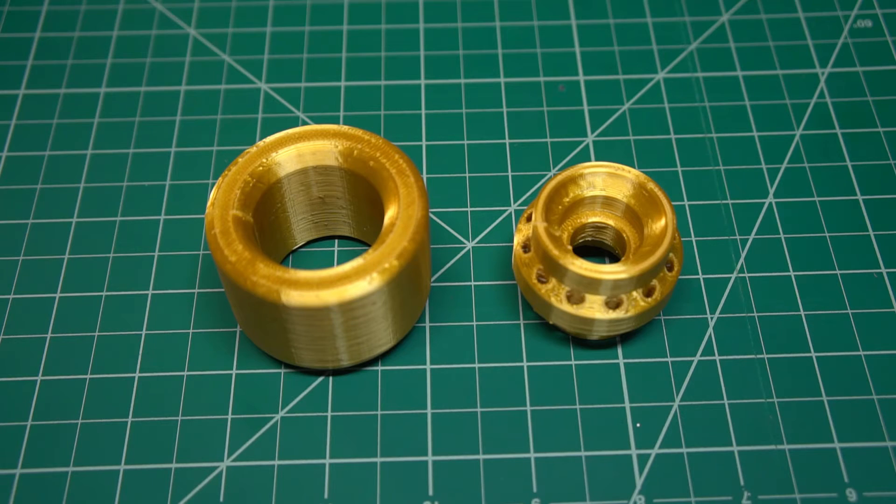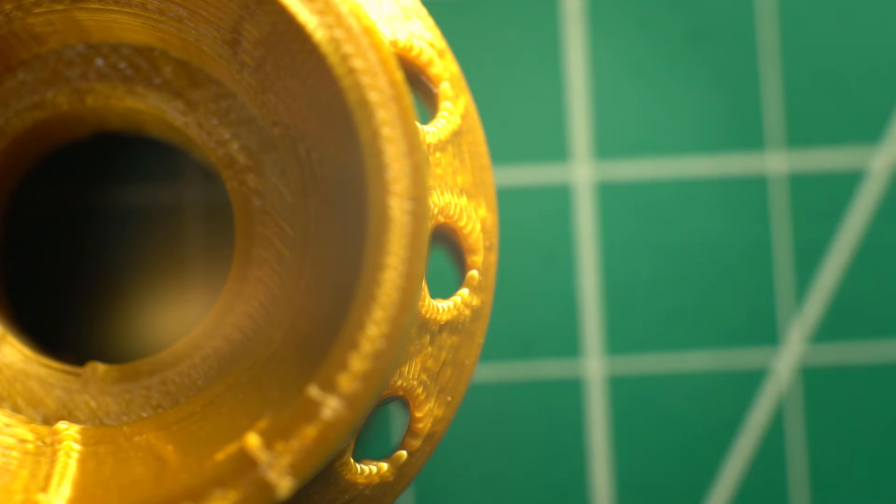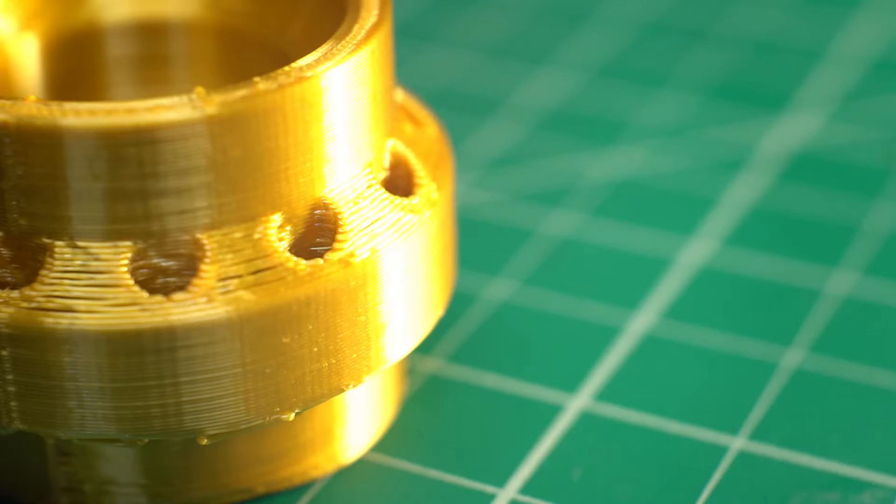Just for general expectation setting, I'm aiming to make an offset wheel with slightly squared lips. Depending on what durometer I cast it in, I imagine it could be a good freestyle wheel or a fun small cruiser wheel. This is the first set of designs for the core and the urethane part of the wheel, and I printed it to get a sense of proportions and shapes. Looking at this set, I pretty quickly decided that I wanted more urethane and less core. This flange is an important component — it's what really bonds the core to the urethane. When the wheels are cast, liquid urethane flows through all these vents or spokes in the hub, and when it cures it locks the two components together. This retention ring on the first iteration is too thick and the holes are too small. So more urethane, a less massive core, and a smaller more open retaining ring gets us to Version 2, and I'm liking these proportions a lot more.